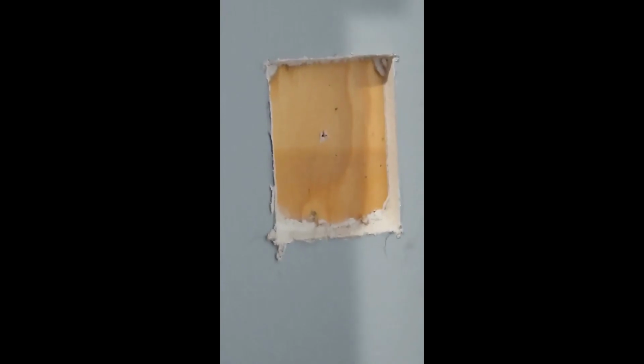Now I'll take the saw and cut that out of there. See, now I got a 1/2 inch guide there. So I'm going to take the jigsaw and I'm going to put it right against that plaster board like this. And I'll just start it in at an angle, cut that down, come over to the other side, put it right against it, cut it down, and hopefully I can cut that block out of there. Got the plug in, got the wire pulled through. All I gotta do is put the receptacle in it now and be good to go.